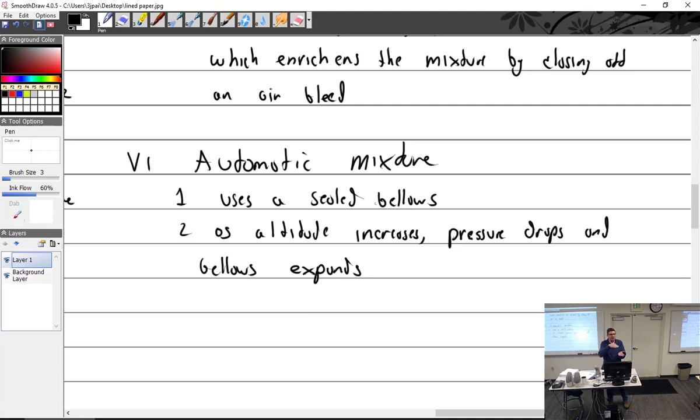So anyway, it had a bellows on the top. These carburetors remind me of the two-stroke carburetor on my Honda dirt bike, where it had a slide instead of a throttle valve, a slide with a needle on the bottom. Are you guys familiar with that? Okay. What it did is, as you went up in atmosphere, it had a bellows on top. I don't remember exactly where it was sensing it and where the springs were, but the bellows moved one way or the other, depending on how the carburetor works. I guess it would drop the needle back down a little bit, restricting some of the fuel that would go through. So you'd have to know those carburetors, if you ever worked on a motorcycle, the valve and needle arrangement. But my point being, it had a bellows on it. The bellows was affected by the atmosphere. The atmosphere then made a change inside of the carburetor, which caused it to go lean.